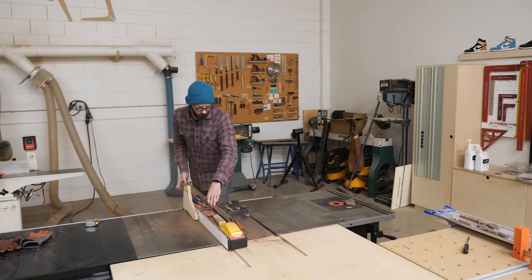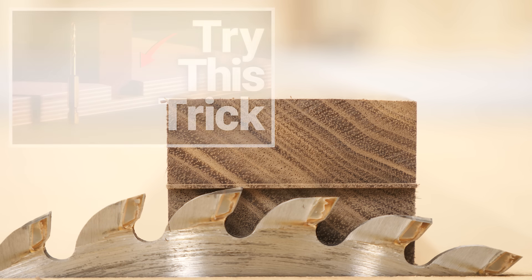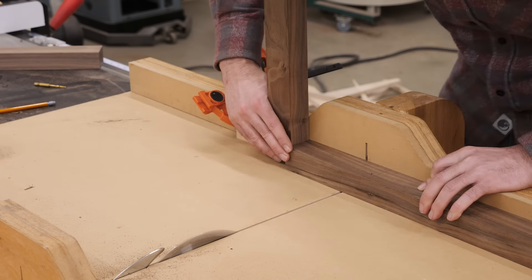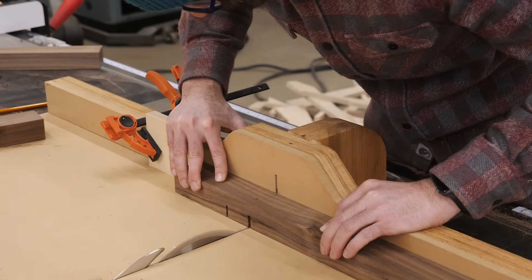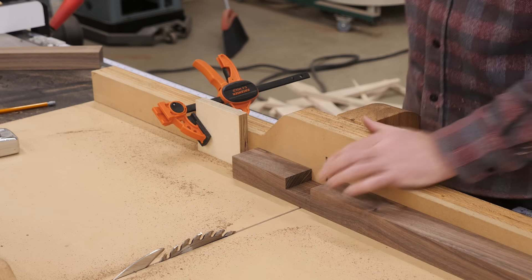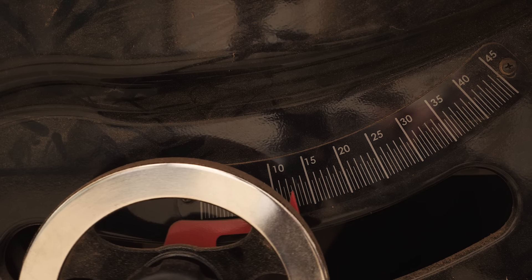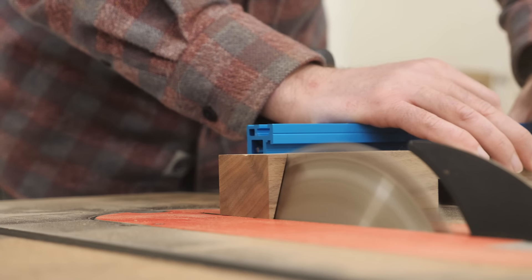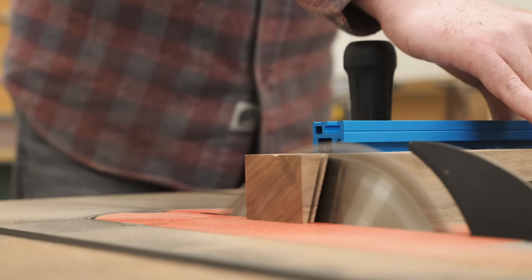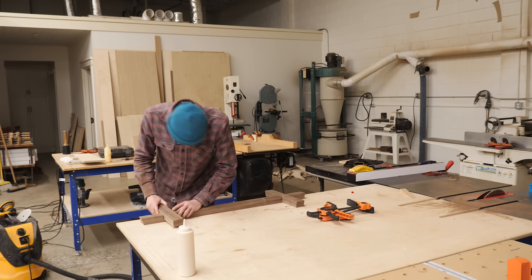After milling all these pieces, ripping them to finished widths, and leaving them a little long, I'm going to use two woodworking tricks from our series 'Tips and Tricks That Every Woodworker Should Know' — linked in the description — to dial in the exact blade height and cut the dados to the exact right width. I won't go into detail here since it would take about 8 minutes to explain. Also, we left the pieces long when we cut the joinery because it's much easier to cut joinery first, then cut to length, rather than cutting to length and trying to perfectly position joinery afterward.